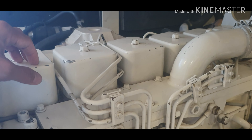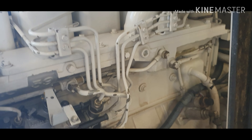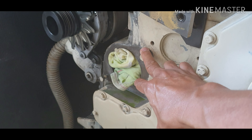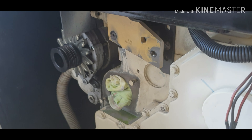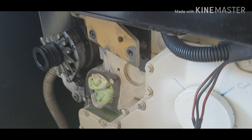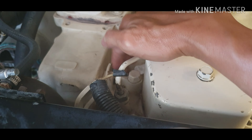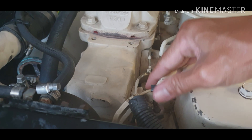I'm also going to change the oil filter and remove this cover to check the valve clearance. We're going to open this — six cylinders — for valve clearance. We check everything. And as I said, we removed the water pump already because it was leaking. This is the water pump for the 40 kilowatt, and also the water pump for the 20 kilowatt — we'll change both with new ones.